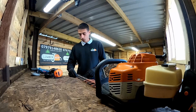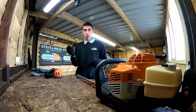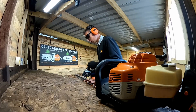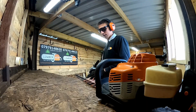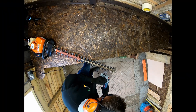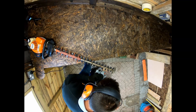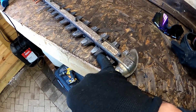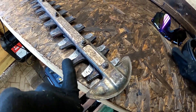You don't want them getting too thin — you just want to neaten them up and get that sharp edge back. Remember, stick some gloves on, eye protection and ear defenders. Run it and very gently brush the teeth very lightly. Always keep the angle that is already on the teeth, just like so. You can see where it's much more shiny on the teeth where I've sharpened them, just brushing that edge off.